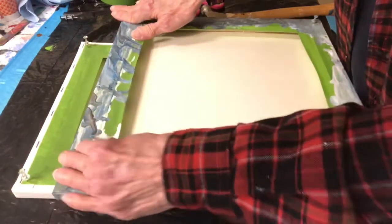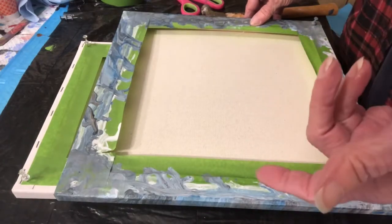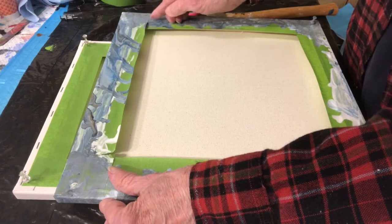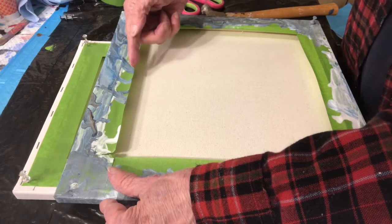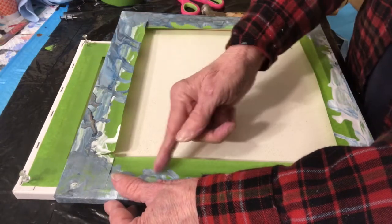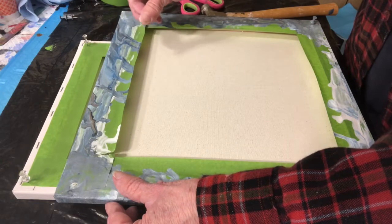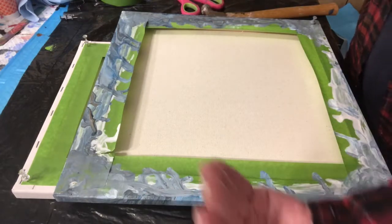I just don't like spending any more time on the backside than I have to. Now if I put a wire in one, I will go down just a little ways from where the top stretcher bar is — about an inch or inch and a half. I put in an eye bolt, put my wire through, loop it through twice, and then twist it around the wire. Then I go over to the other side, stick it in that eye bolt, cut it out to there, put it through again, bring it up and twist it again. Then I use electrical tape to tape those ends so nobody gets stuck on that wire.